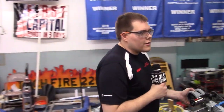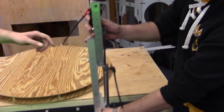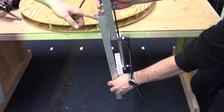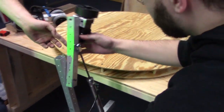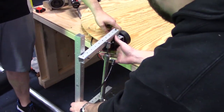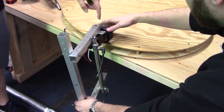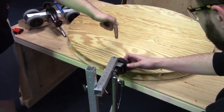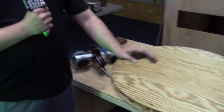That really concludes our overview for the day. There's lots of great stuff on our robot here with plenty of different components. We also have a prototype wheel device — it has a pneumatic cylinder that starts up and will be mounted somewhere on the robot. It comes down and lands on the disc itself, and then that wheel spins so we can move to a different color. We'll have the color sensor integrated as well so we can see what color is active and spin the right amount.